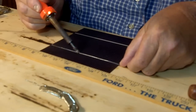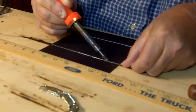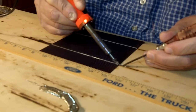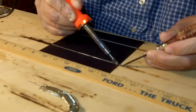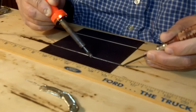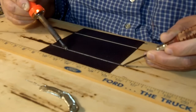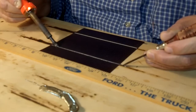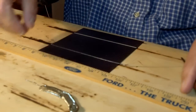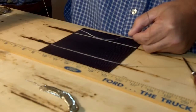I just take my hand and hold one end, put a little pressure on it and pull so there are no kinks and it's nice and flat. They go all the way across — just stick it in a couple places, then hold it with the screwdriver again because the wire gets very hot, and just slide it along real slow. You can tell the solder is sticking when it looks molten — silvery and liquid — and that means it's also liquid on the bottom side and actually sticking to the solar cell.